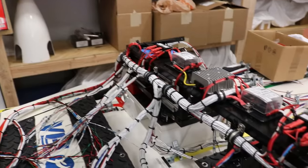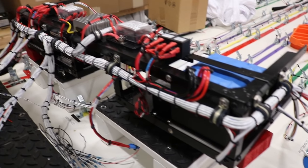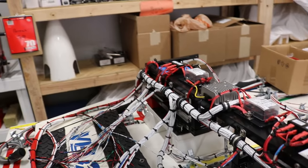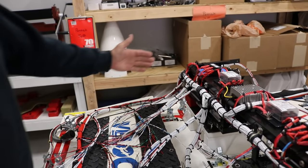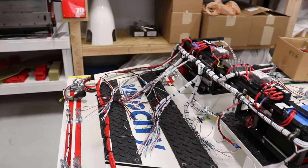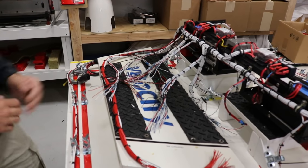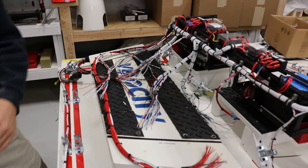So this will be the avionics, the airframe, and in this case, it's actually the engine harness all built into one. The way I like to do it is I build the back tray and then we lay it into the jig here and then run the wires accordingly. Try to keep it very clean. A little OCD sometimes with my wiring.